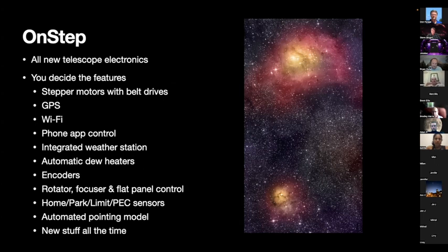I wanted Wi-Fi on mine, so I added that — it lets me connect with the phone straight to the telescope to do diagnostics, setup, or even run it from the phone. I added an integrated weather station, and that ties into automatic dew heaters. Through NINA with ASCOM, I just turn them on and the settings are already in the background — it detects the weather local to the telescope and sets the dew heaters automatically to the heat required to keep dew off.